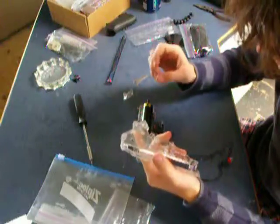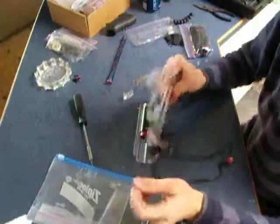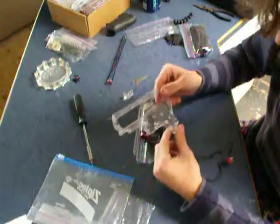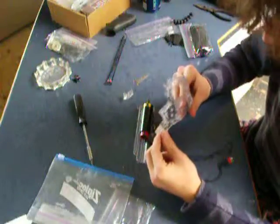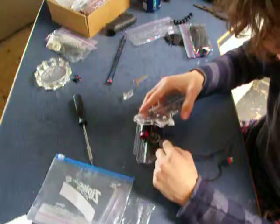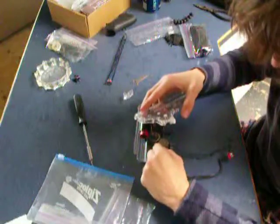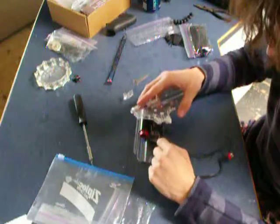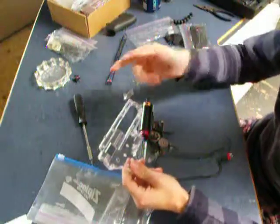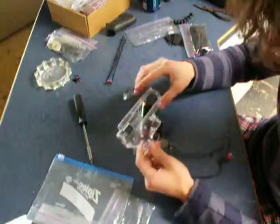When I tested it before I shaved that peg off, it did work. It was close enough that if I put the screws in, it would tighten down properly. However, it was very tight, and this really is powered by nothing more than a spring. If this wheel goes around, it knocks it out, and if this tries to reverse, you destroy your gears — which I am now using expensive ones, not cheap ones.